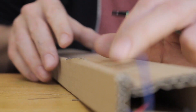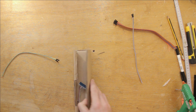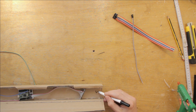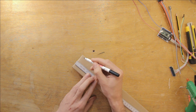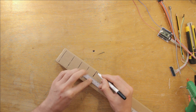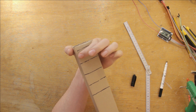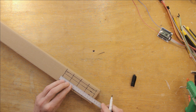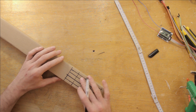It's time to define where everything goes and how to hold and play the instrument. This will be the right hand and this will be the left hand — so this is where I'll pluck the strings and this will be the fretboard. I'll draw in the frets about 3 centimeters long with around 1 centimeter between the strings. For some reason I decided to make the distance between frets progressively shorter up the fretboard, which is very realistic for a bass guitar but definitely complete overkill for this prototype.